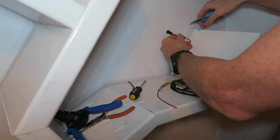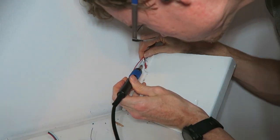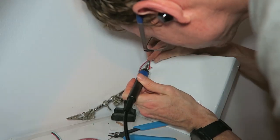These specific strips have some connectors on each end, which make them really easy to daisy chain together. Unless you don't want any gaps in between strips. So I ended up cutting off those connectors and then soldering the strips together so that the space in between those LEDs was as close as possible.